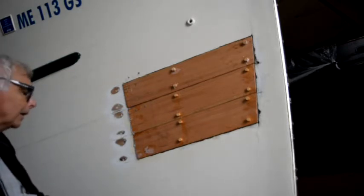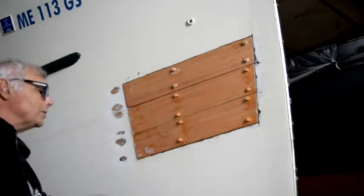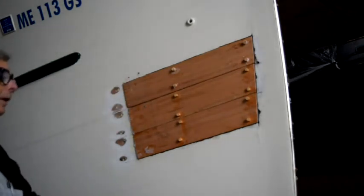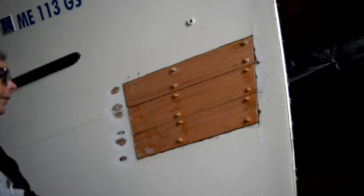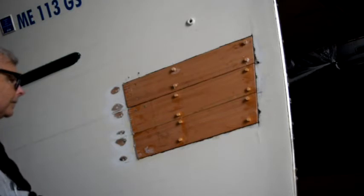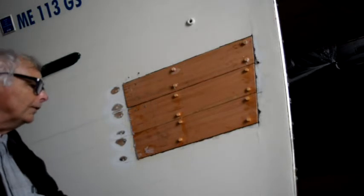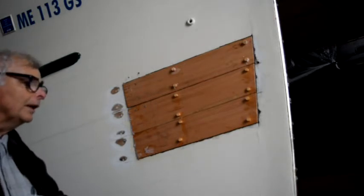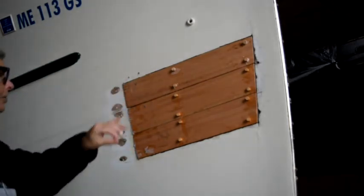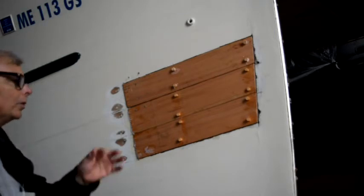Once that's done, I'll come back and caulk these seams by hammering caulking cotton into them. When that's finished, I'll put seam putty over them, let that cure for a few days, sand again with finer paper, and start painting. I want to get three coats of paint on this fall so I'll have a good base to work on next spring. So that hole is filled and the plank ends are scarfed on, so they're as strong or stronger than the wood that was in there before.